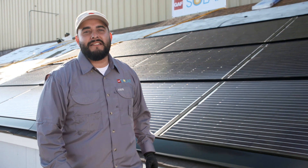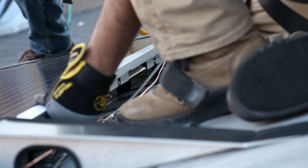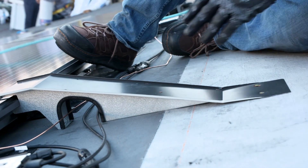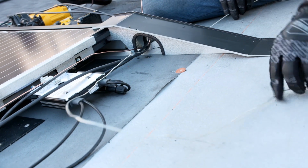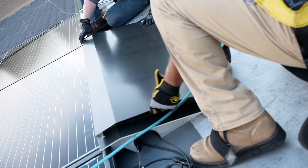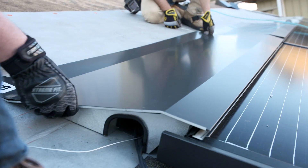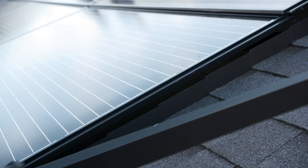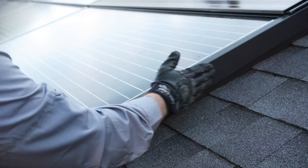Now that you've seen how easy it is to install the system, we're going to go over all the flashing. There's a top flashing insert that's factory built to snap into place. Supports go on the ends and between the seams of each panel — they're nailed in place. Before all this is covered up with the top flashing, we fish through the dyno bond, which is the U-shaped wire that grounds the top flashing to the system. The longer piece connects the grounding to the weeb lug. The top flashing interlocks with the flashing insert — push it firmly in the center so it interlocks properly, and make sure it's straight across the top before securing it. Use four to six nails per top flashing. You step flash up the sides like you would a high-end skylight. The counter flashing is one of the finishing touches — no tools required, it just snaps into place.